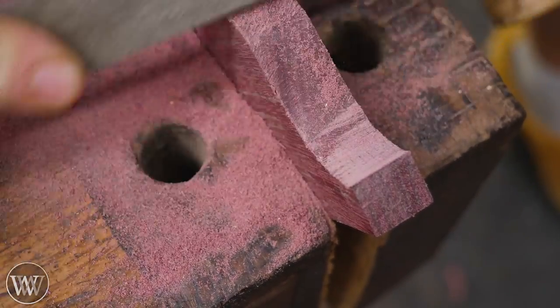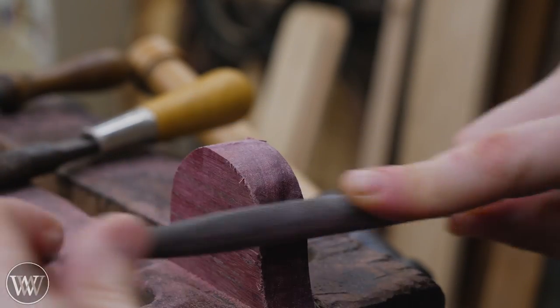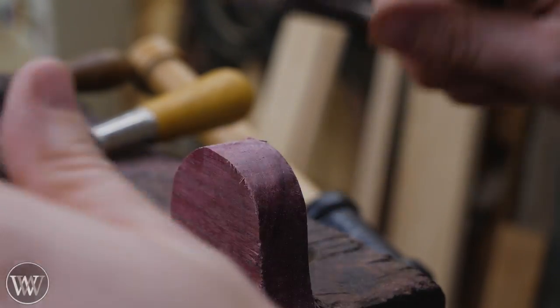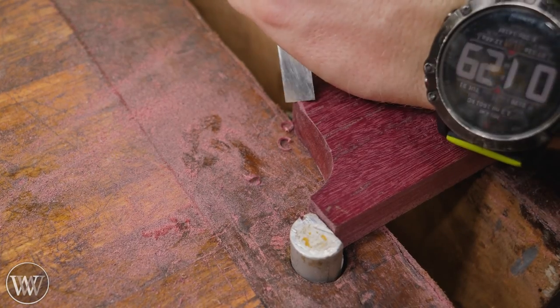This file is a little bit rough, so I'll come in with an even finer file after this and get it down to a really nice smooth surface. You can see how in just a little bit we've got down to a really happy surface. Having a good collection of files and rasps can be an amazing thing in the shop. Most of my files are just standard metalworking files — they don't have to be anything special. The rasps, though, those are pretty special to woodworking.